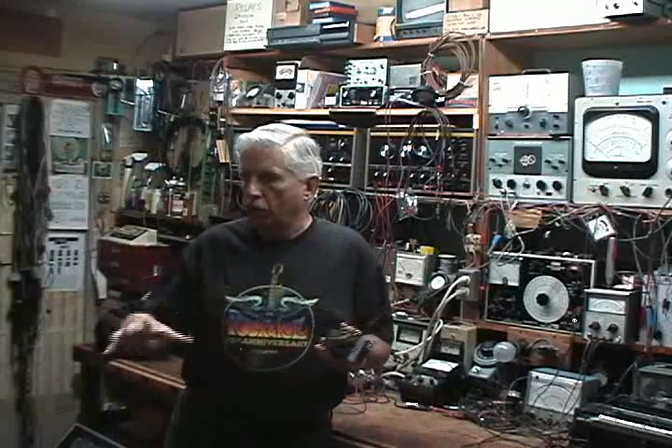I enjoy the hobby, and I'm going to share some of what I have learned pertaining to power transformers. One thing you have to consider is that your line voltage nowadays is about 125, some even as high as 127 volts. These old radios of the 1930s — and even the 1920s — are designed to run on 110 volts, sometimes 115. A transformer running very hot is a common problem that people have, and they don't realize this.